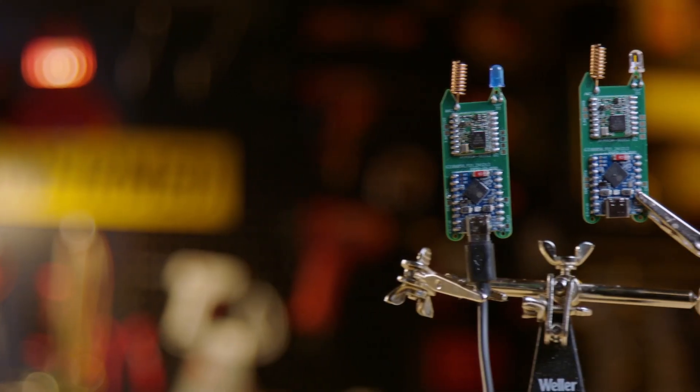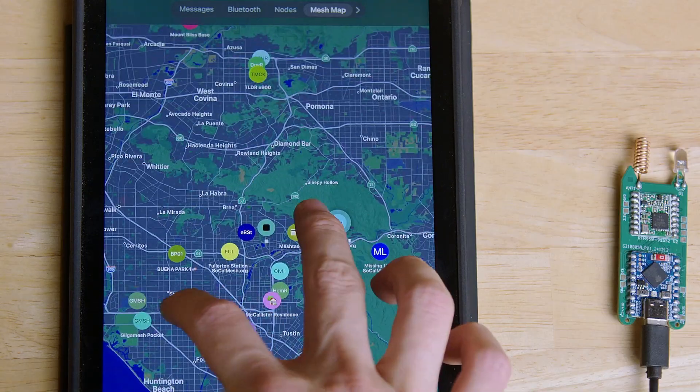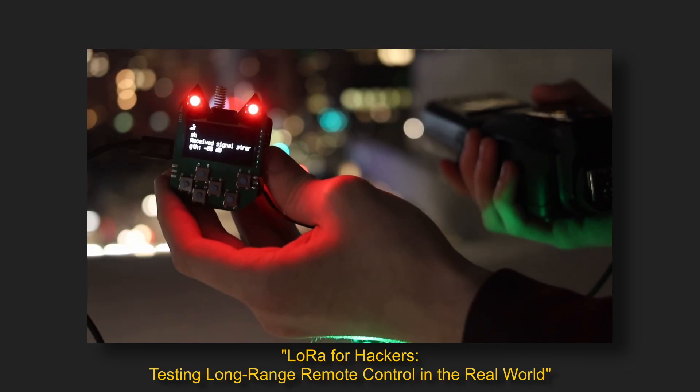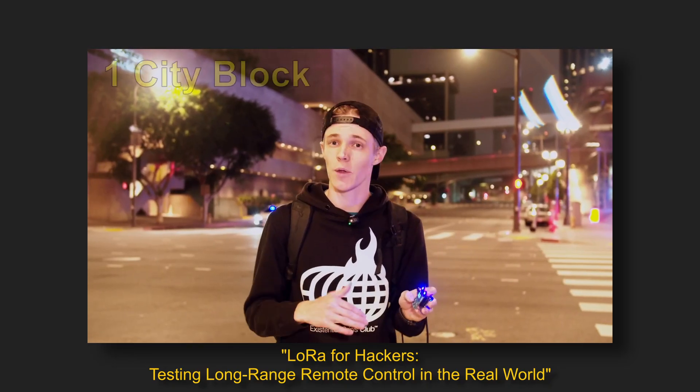For ESP32 versions you can even track passing Wi-Fi and Bluetooth devices with the PAX counter function. With the tiny size and low power requirements of the Nibble, you can easily make a network of solar-powered nodes to report back data over extremely long distances. For more advanced users, you can write and compile your own firmware in either Arduino or CircuitPython to directly interface with the LoRa radio. Over on the Nullbyte channel we pushed these radios to their extremes and found they could still communicate at ranges reaching almost a mile, even in a crowded downtown environment. We'll throw a link below to the software packages you'll need if you want to try these out yourself.